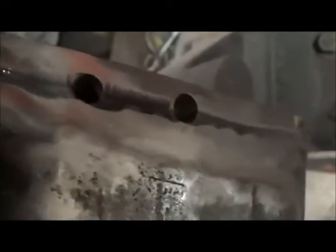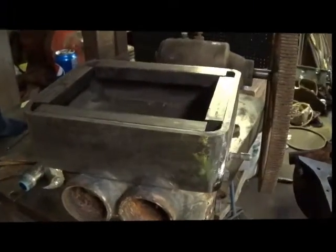I've beaten this out really good, rounded the corners on my piece, got a good weld around it, and now we're going to grind it and get it all looking like one piece. Got more to do on that side but we're working around it. We'll get it all done shortly. I've got everything blended in here and it's looking pretty good — just a little bit more to do.